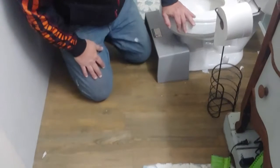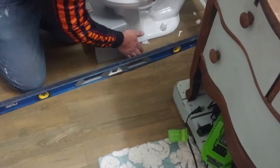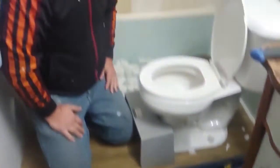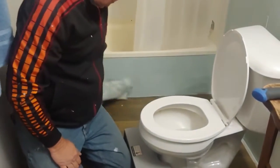The reason is as soon as I came to this house a month or two ago, I noticed that this floor had been wet. Now, how do I know that? Well, I could see a hump. Matter of fact, you can see this is leaning. How much of a hump? I can stick my finger, so maybe 3/4 of an inch between here and here where the floor joists are. So, and it's kind of the case all the way over.